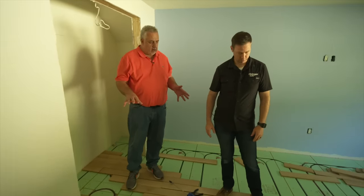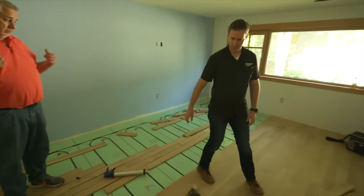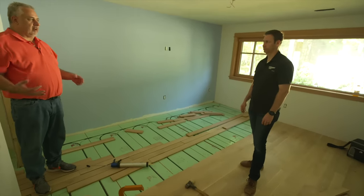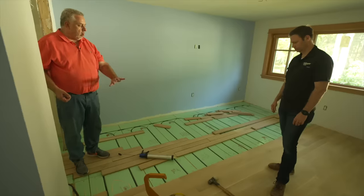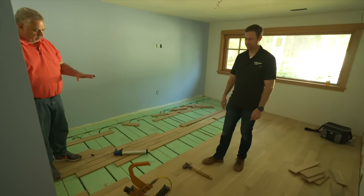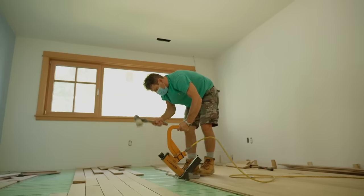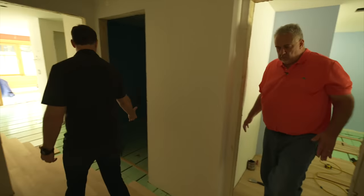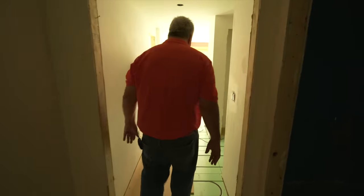We've actually been ready here for about six weeks. We had to wait for the hardwood floor for the moisture content to go down. August in New England, everything's taking on moisture, so we had to get that down. It's a five-inch white oak, so the flooring association says we need to glue it and staple it. Underneath everywhere there's hardwood, Steve, we've got these radiant floors. These are different zones, meaning you could control some of these rooms independently.